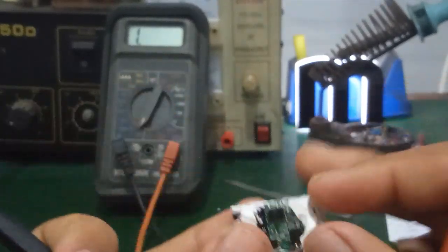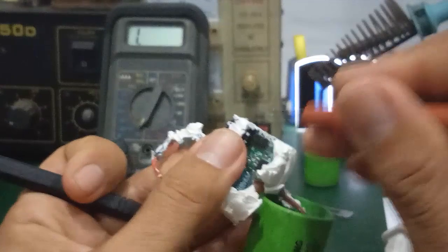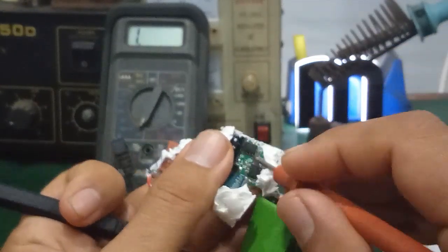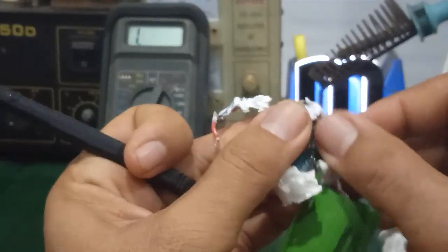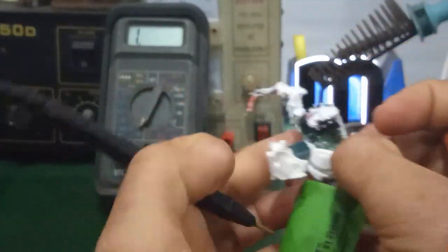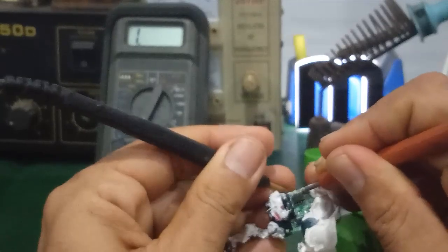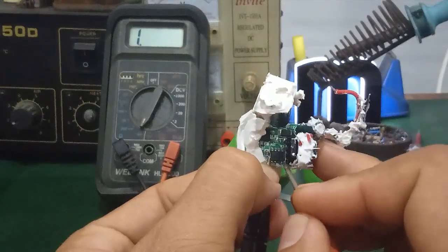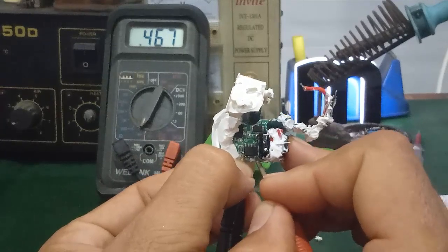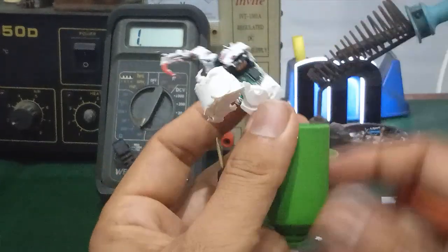Next, measure pin 5 and pin 8 to check the internal MOSFET. If the IC has failed or exploded, the MOSFET inside is also damaged. When testing pin 1 to pin 4, a dead IC will either show no reading at all or a dead short. The value measured for pin 5 to pin 8 is 467 ohms — one direction reads, one direction does not — so this IC is good.